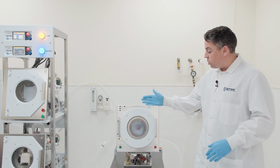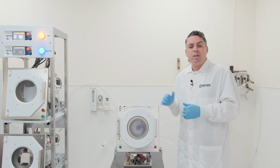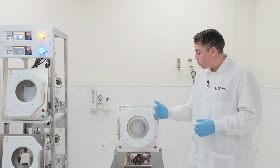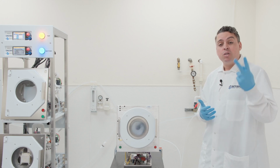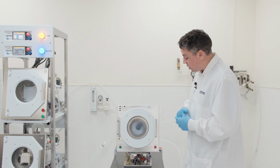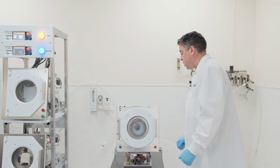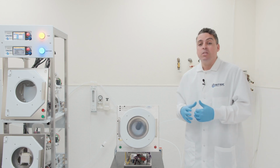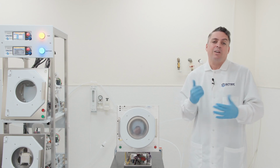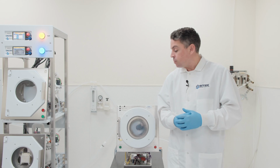And then we're going to go to a lower RPM dry 2, typically about 500 or 600, and we're going to stay there for maybe 5-6 minutes and let the heating elements complete the dry. Your SRD has 2 main heating elements, which is our N2 heater located on this side with this chamber, as well as a heater blanket located on the bowl side over here. So both of those heater elements are going to give a uniform dry to your cassette and substrates, so that way when the SRD is done, you can move it over to any next process step and be ready to go.